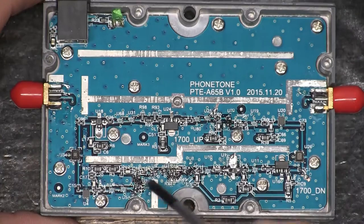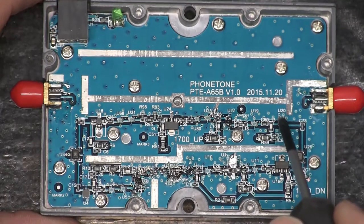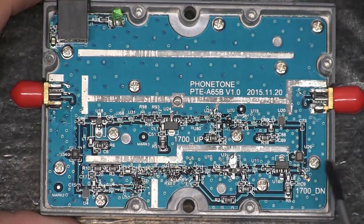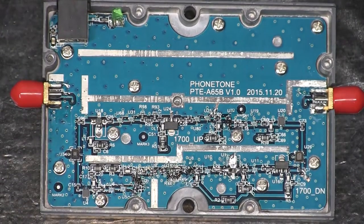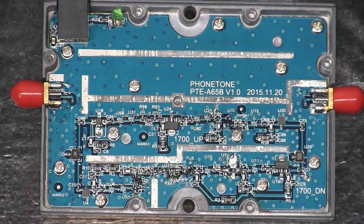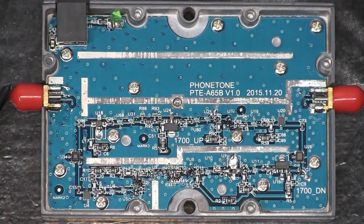I don't know if this is like an IF being mixed in or something — I don't know what that chip is. It looks like a similar package as that other one. Regardless, you've got this lower power transistor which is probably just a preamp, and this is the actual output power amplifying transistor. The unit mentions uplink +60 dB and downlink 65 dB. In dBm I don't know the exact figures, because when you mention stuff in dB it's just a logarithmic gain from what the input is.